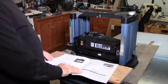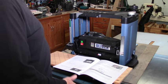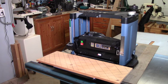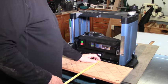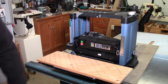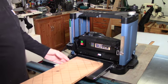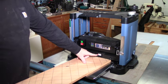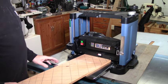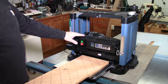To set up the digital readout meter, the instructions ask you to plane a board flat first. I've got a piece of approximately half-inch stock, nine and a quarter inches wide, and we'll run that through the planer. I've set it to take a one thirty-second pass. I put a little crosshatch pattern on the board so we can see how it does, and let me turn the dust collector on.